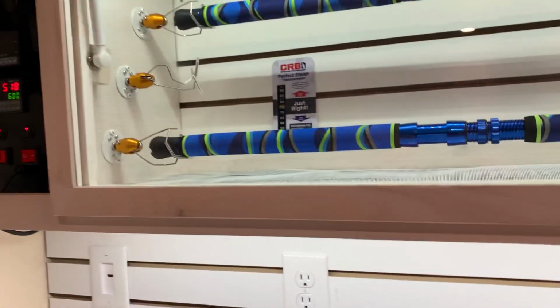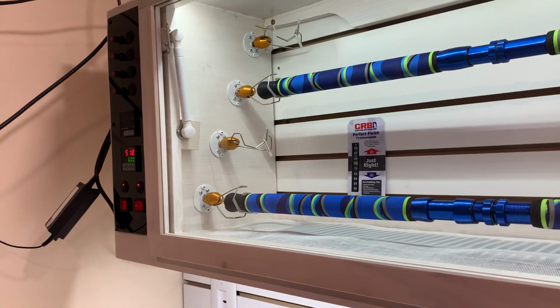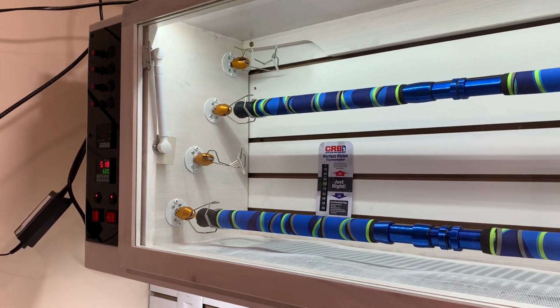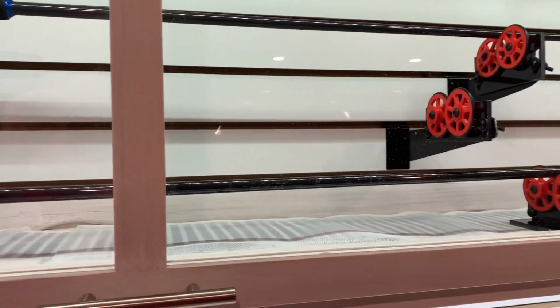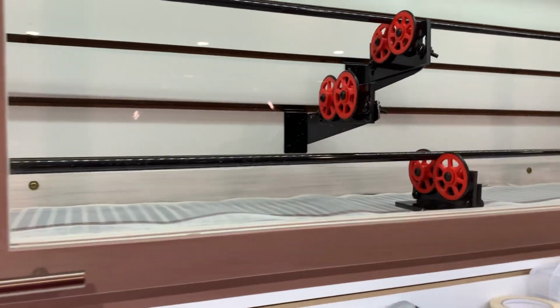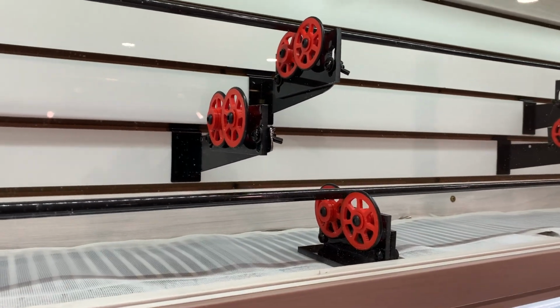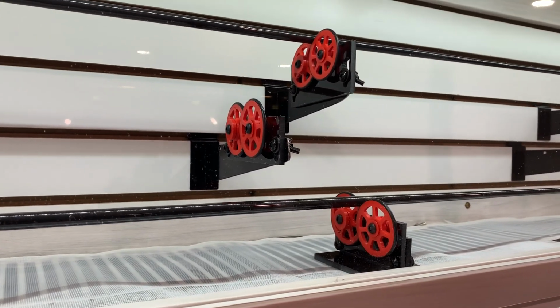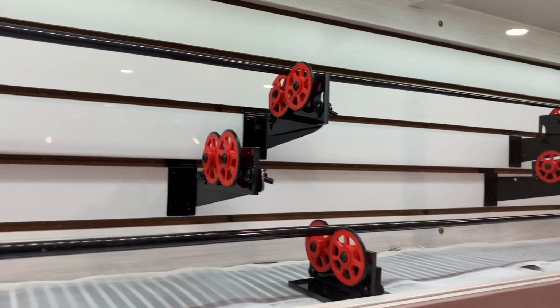Few things I didn't fully account for: my measurements on the alignment of the slat board to my motors, so I had to play around with the wheels and some spacings there. Had to make a little adjustable offsets. Can use that, probably helpful anyway, depending on the diameter of given rods that might be built.